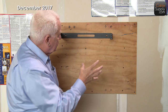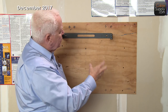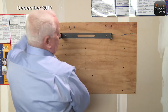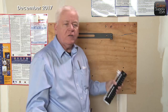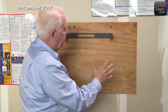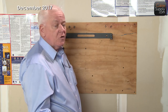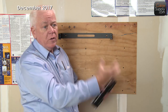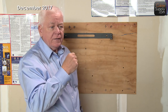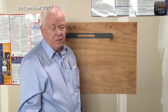You put your cabling right in the middle, and then I'd need a ton of 66 blocks — though you don't need those anymore. But if I did need them for a phone system, where would I put them? You think it through. At least that cabling guy knew enough to leave a service loop. He just didn't know enough about the economy of designing a backboard. It's not that hard — don't hog the whole backboard. Put your equipment in such a way that your gear can connect to other equipment and you're not in the way of other vendors.